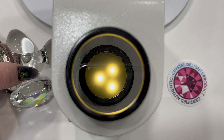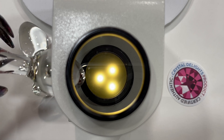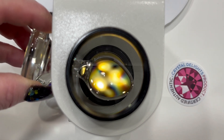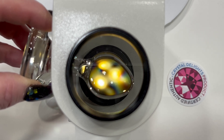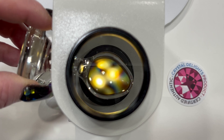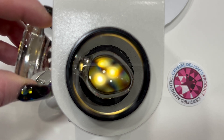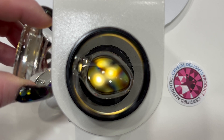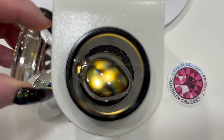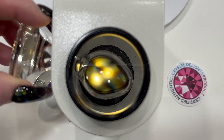First I'm going to show you an unannealed plug, and when I put this through the polariscope you are going to see rainbows. Can you see all those rainbows there? Each of those rainbows has a tiny fracture inside that glass and that's causing the light to bounce off of it. What we tell people is that you can heat up and cool down your plugs — well in this case that's really bad, because each time you do that it's going to increase the stress on the glass and eventually those fractures are going to break.